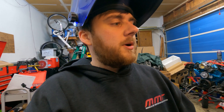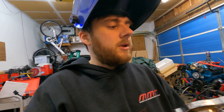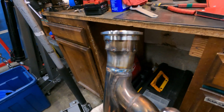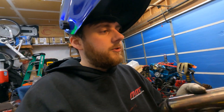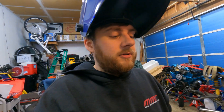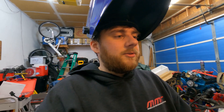I don't really think the back purge matters so much for the manifold side versus the downpipe, which has been totally back purged. Some of these pieces will probably go back and get back purged. I did add some tacks all around the top here to mitigate the warping. I did also get a little bit on the V-band — you can see the color, all pretty. The color goes away if you wire wheel it, but I kind of want to leave it on just for now because it looks so pretty.